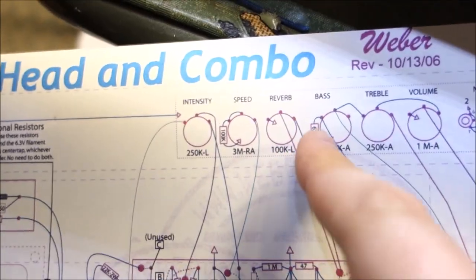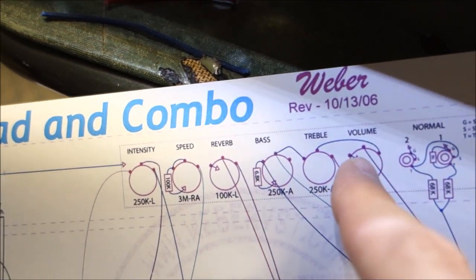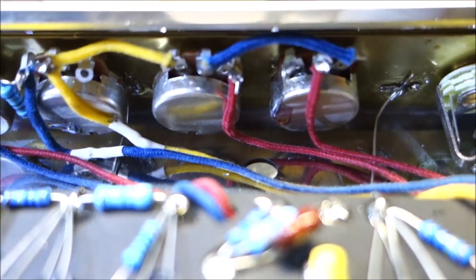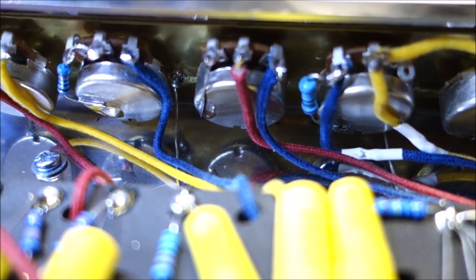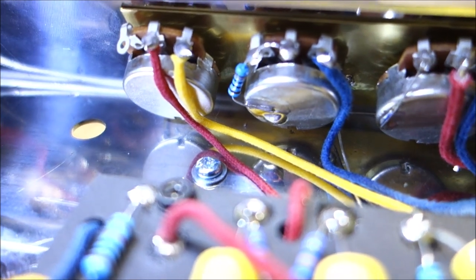As far as the resistors to ground, or the leg of the pot that is to ground, we can literally just do that. The volume pot, we just have a little clipped lead soldered right on the pot. The pot is on the brass plate. The brass plate is ground. Same goes for that resistor and that resistor. And yes, I have a solder drip. Oh my gosh, that's my second mistake. I used a little too much solder in one spot.